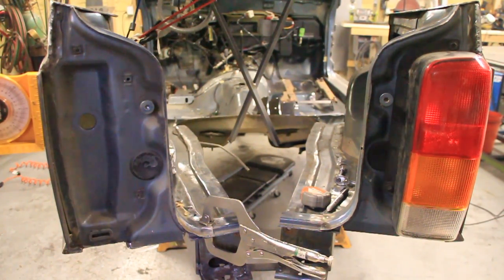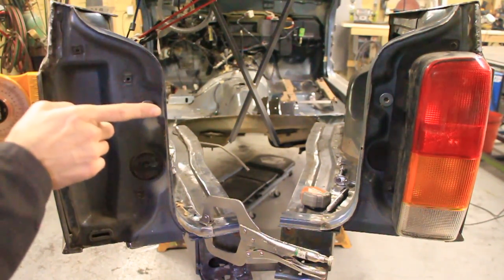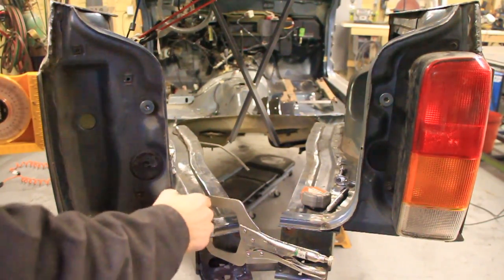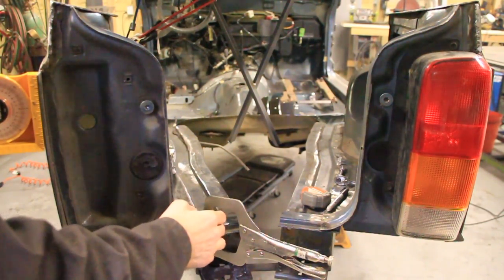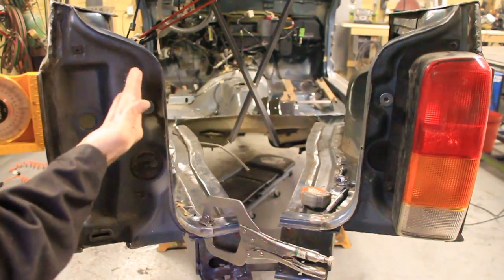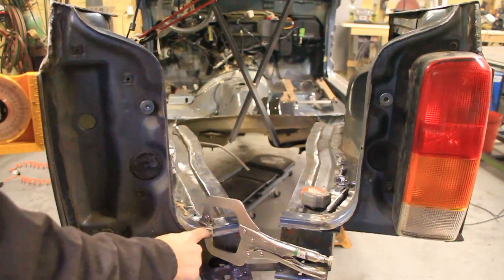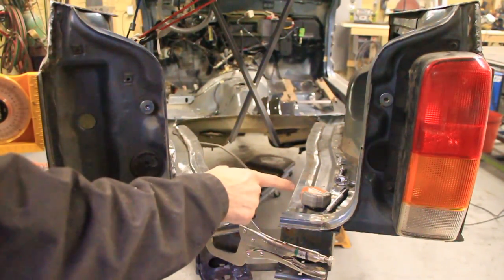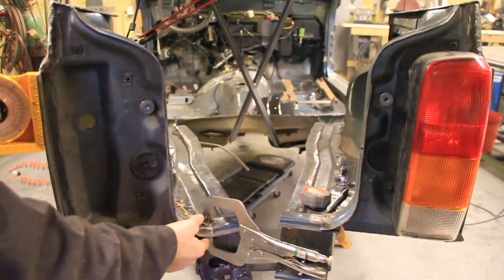We're at 87.5 degrees right here, which is exactly where that side was. When I set up the frame, I also used a plumb bob from the roof, to make sure everything was square. I've also checked right here, not only is this at the correct angle this way, but this is exactly placed so that it's the same distance as that one away from the frame.